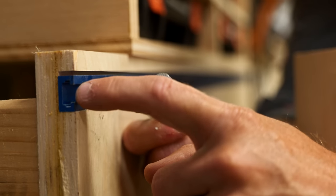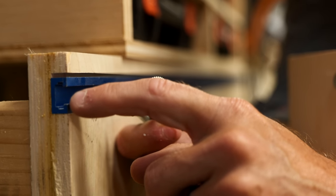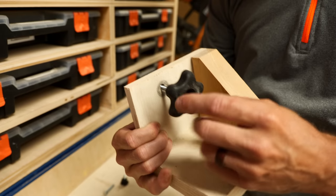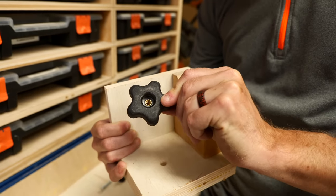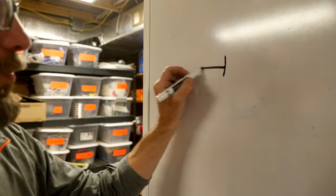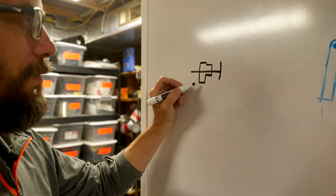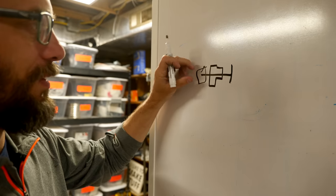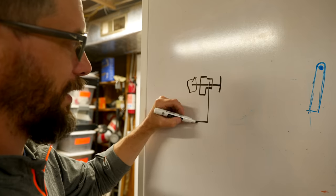This project is absolutely not about doing it cheaper or easier — it's just about doing it myself. This is the T-track that we're going to be sliding this thing into, so eventually we'll have to take measurements of all the inside shapes so we know how big to mill the pieces. I'm going to start with this and then build something that comes out from it. There's going to be a piece that fits in the T-track and this piece is going to be flat so that it won't be able to rock or twist. Then we'll have the handle out here and that'll be twisted to tighten these two things together. From the side there's also going to be a leg that will come down and actually be the stop block — that's what the wood will touch when I'm setting it up on the saw.